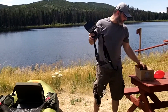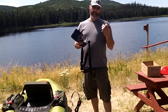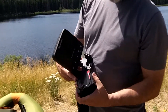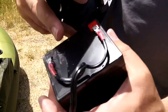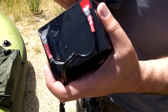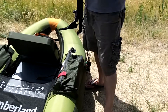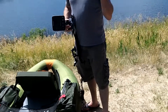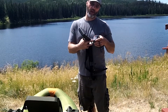I've got my battery here and I've used the same power cabling system that we have in our powered kits. I've covered off one of the terminals using some tape — I got a little lazy, didn't use anything elaborate — but just to make sure nothing would short this battery. We do not want this shorted; that's very dangerous. Make sure you don't just stick it in a pocket where you've got metal pliers or needle-nose scissors that could cross the terminals.